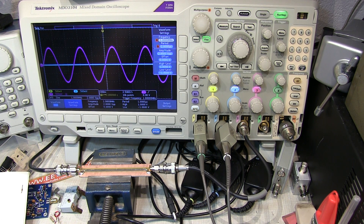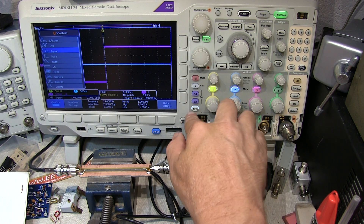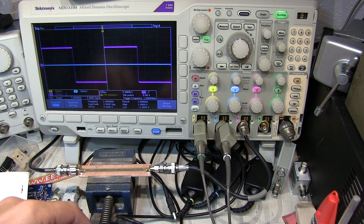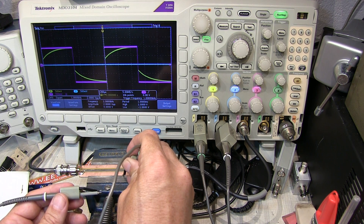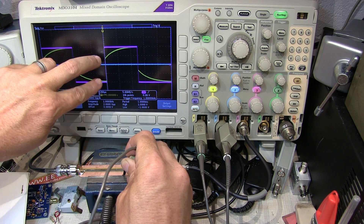This is what it looks like for a single frequency input. But if we have more complex waveforms — digital waveforms, square waves or logic waveforms — not only will the amplitudes be wrong, but you can also get distortion. I'm going to change the signal frequency back down to 1 kilohertz and change the waveform type to a square wave. Looking at channel 1, this waveform is distorted — we're not reaching full amplitude, and we're getting an RC-type response up to the full amplitude. This indicates the probe is undercompensated and the high frequency components are being attenuated.